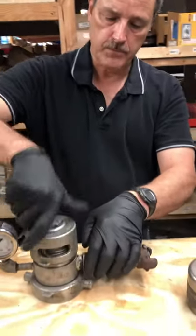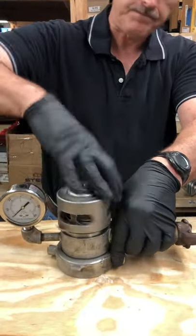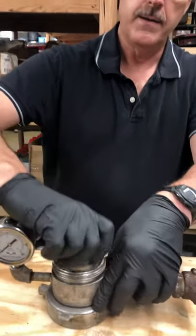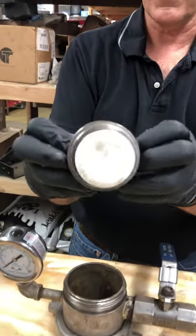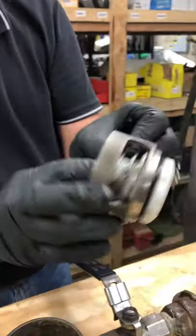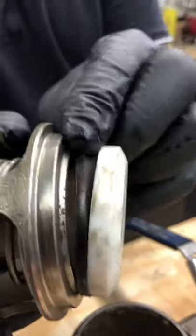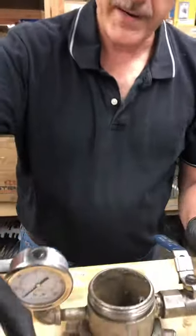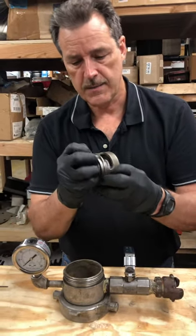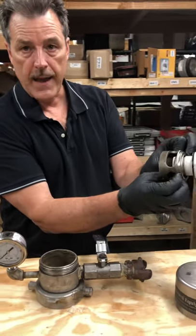Remember, this is how it goes: set it on the ground, unscrew the top. This comes off — the magnets are inside. This comes off. This is the gate; this is the valve. On the backside of this valve, you can see there's a rubber O-ring as well. The rubber O-ring also fails. What we find a lot of times is this is all gummed up in here — the valve is okay, but this is gummed up. So you need to get something and clean it out to make sure it's nice, so that the valve can go back and retract.